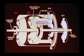When the power shift lever is in high or third, clutches number 2 and 3 are engaged. Power is transmitted from the input shaft directly to the output shaft for a direct ratio power transfer. The engagement of the C3 clutch locks the outer drum to the output shaft, and the engaged C2 clutch locks the planetary carrier to the output shaft. Any rotation of the planetary gears is prevented.